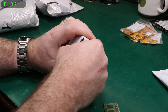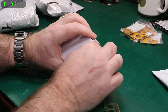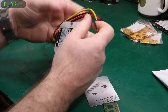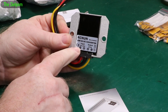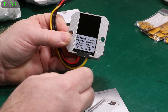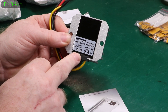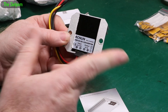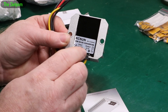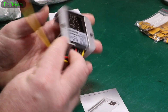This is also for the motorhome project, but I've since used a different device because it's what I had on hand. I would have used this if I had it — it's a small little buck converter. It can handle 12 to 24 volts, and it outputs 5 volts at 5 amps, which is perfect for what I was working on. I needed a 5 volt power supply to run the Raspberry Pi and the touchscreen, and 5 amps is enough — I need literally 2 or 3 amps at most. Good headroom, basically double the power, nice and compact.